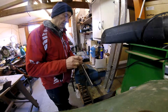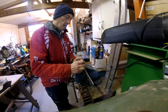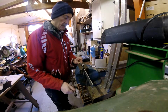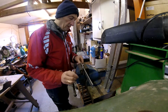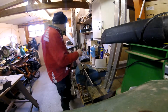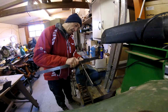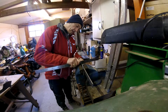Put a bolt there, right on the centre line. Put one bolt there, one bolt there. Just nip it up slightly, just adjust them so that these two are the right distance from this one, and then you can centre that one accurately by rolling it along, and then just take a straight edge and make sure that the bend is going to be perpendicular, so you can just line it up like that.